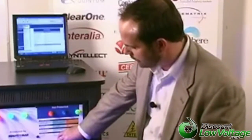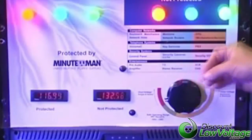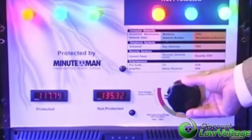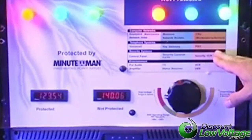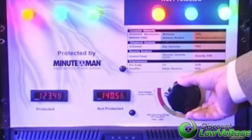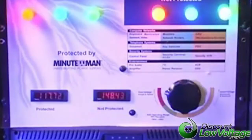That covered the brownout situation. Let's cover the other scenario where the voltage is coming in too high. You'll notice right now on the unprotected side our voltage is at 132 volts, yet on the protected side through the UPS it is at 118 volts — well within a safe range. As the power continues to rise, notice how bright these lights glow. Right now you're cooking resistors and capacitors on the boards of your equipment. Everything we have today has some form of electronics in it, and it needs to be protected by an uninterruptible power supply. Now we're at 148 volts on the unprotected side, yet the UPS side is still well within range.